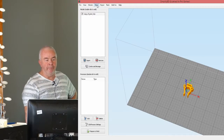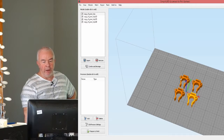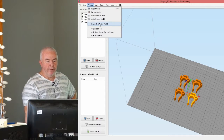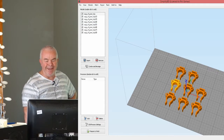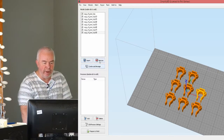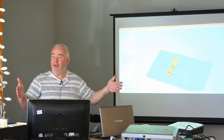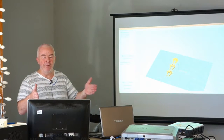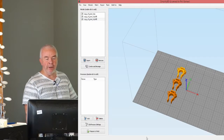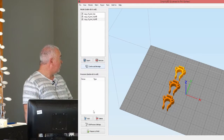Okay? I'm going to duplicate that model a couple of times, so we'll make 3 copies of it. You want to do what I've got called ditto printing turned on in the printer. You've seen those where I'm using both printheads at the time. It gets a little tricky with this software. There's a couple of enhancements again in the software to make some changes. I just need to get rid of some stuff here even though I duplicated it. Basically, I duplicated it to get it to lay it out on the bed properly. Yeah. So now I've just got to roll through. With the ditto printing, I'll actually print 6 at one time with these FlashForge printers. Now I'm going to actually prepare this to print. There's a big prepare to print button. I haven't added a manufacturing process. Add.